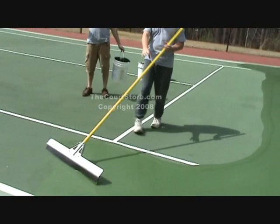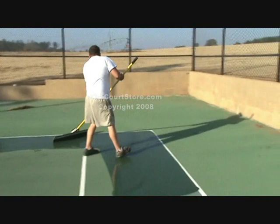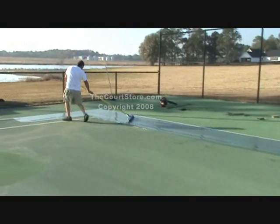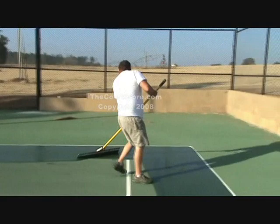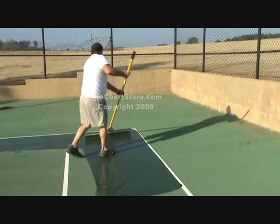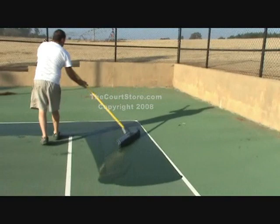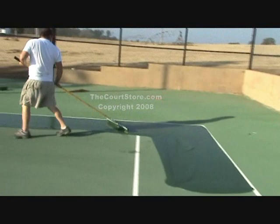To contrast this, let's look at our professional, Paul Montemare. Watch how close his squeegee stays to the edge of that sideline — he actually even crosses over it a little bit. See how sharp his corner is there? He turns and sweeps out to the edge with his squeegee. Right to the edge before he makes his turn. That's probably the single most important thing you can learn from this video. If you can start off like that, you'll save yourself a lot of grief as you coat.